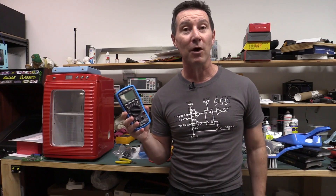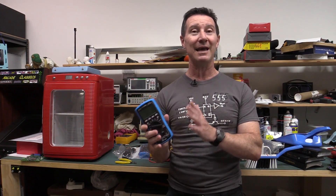Is it plus or minus one least significant digit? Is it half its spec? This is like 0.3% DC volts typical, which actually gives a reasonably wide spec in terms of counts, plus there's the number of counts as well. And how close is it to an absolute reference standard? So I thought we'd get like 50 odd multimeters or so and actually measure them.